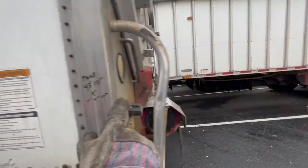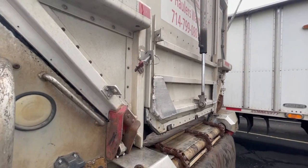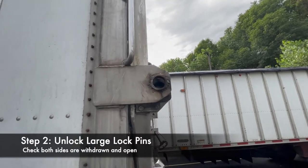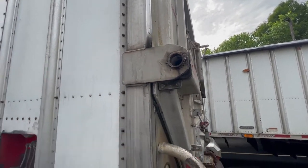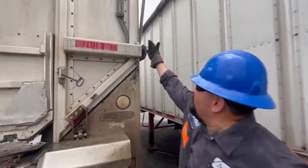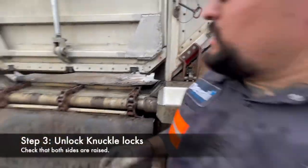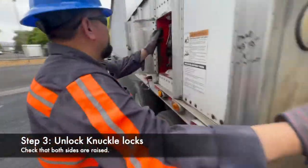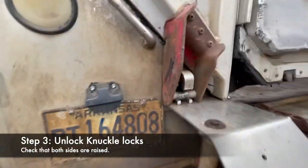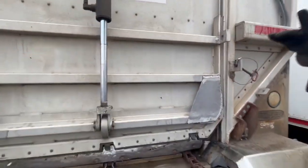First, open the small door, which allows you to correctly open up the big hatch door. Control number two is your big lock pins — open those up, then walk around and make sure they fully opened, because sometimes one side still needs to open. Make sure they're fully open. Once you've checked them and confirmed both are fully open, you can proceed to open your small knuckle pins. Check those as well — come back over here and make sure they're both open. Once you see that they're both open, you can safely open the big back latch door.